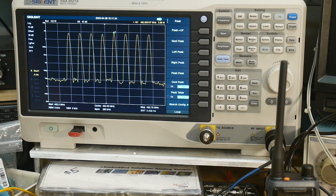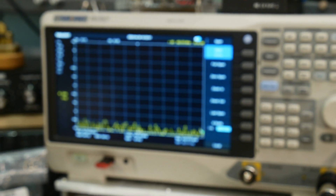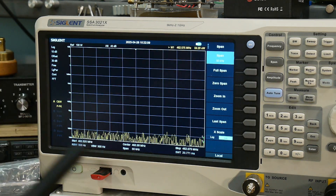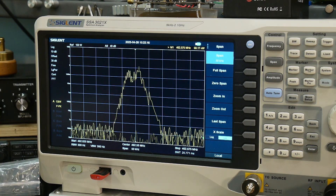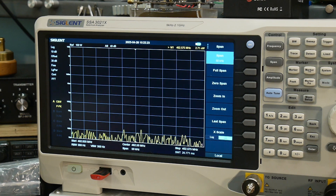Let's see if we can modulate next. We have an audio in — it says less than 100 millivolts — and we have a speaker out, zero to three volts. We can try both of those. I'm going to talk and transmit. If I key down, we should see a carrier, and now we can see audio. Hello, this is a test — audio, audio. So it is testing. We're getting a signal there.